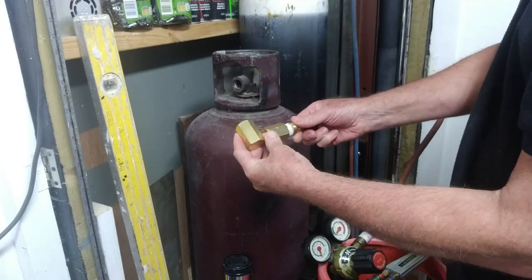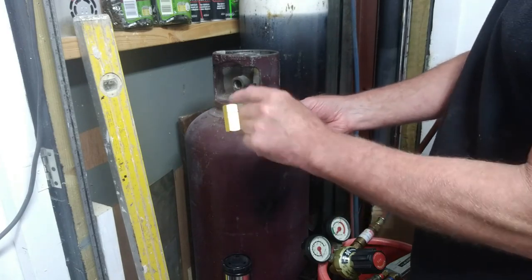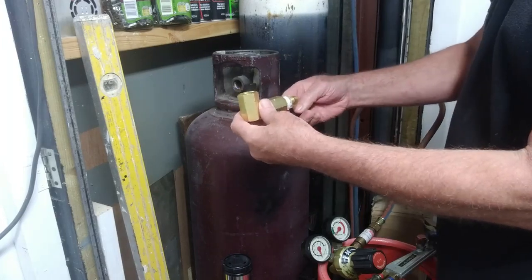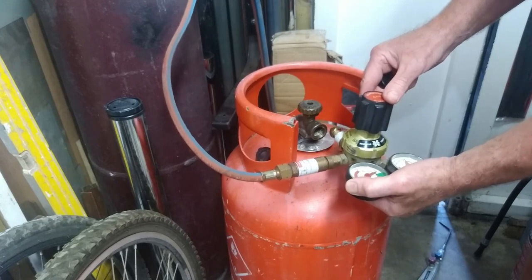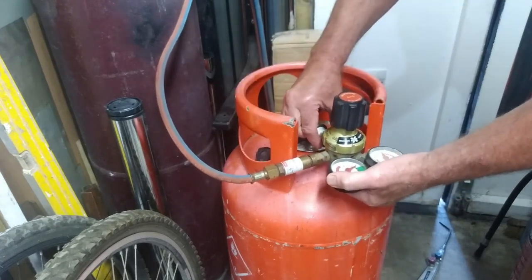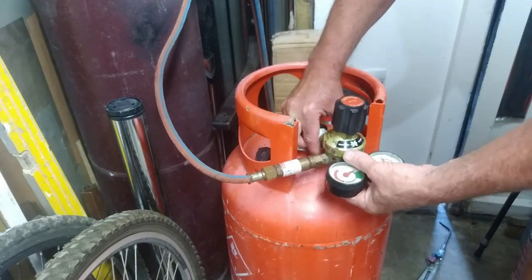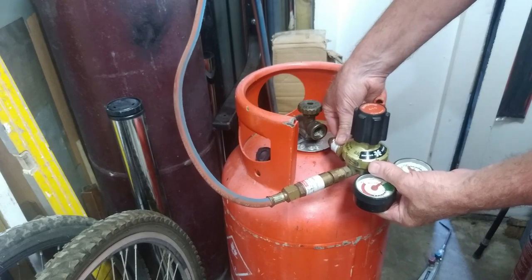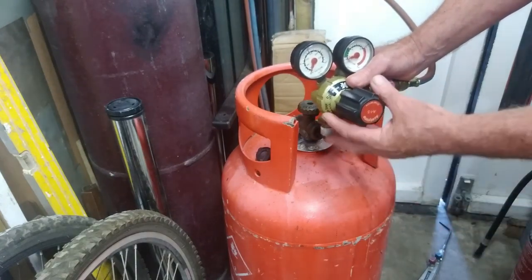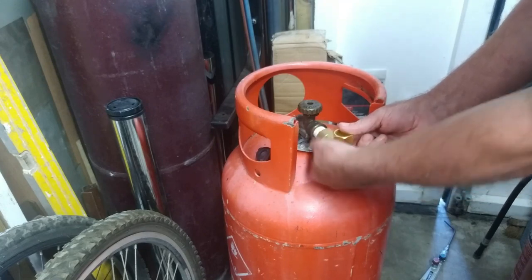I've put a link to these in the description, but sometimes when using the propane bottle, you might need a little adapter, not necessarily an L shape, but certainly some kind of an extender, and I'll show you why. This is the reason why sometimes you might need an adapter, an L shape or an extender, because the neck of the bottle is just stopping the gauge from going in. It just depends on your gauge, where this outlet comes out, and the shape of your flashback arrestor. So you'd want to extend it with a straight extender, or I think it's a lot nicer to have the gauges upright like that with an L-shaped adapter like mine, so you can read the gauges a lot better. Just screw this adapter on with some of the sealant tape.